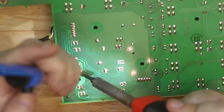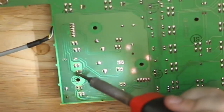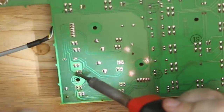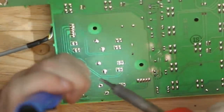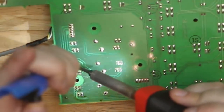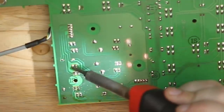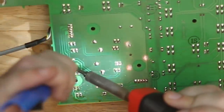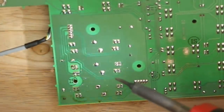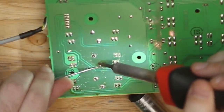Pretty straightforward desoldering. They're stereo faders, and there was an extra leg for either one end of the conductive trace or the wiper, I can't remember which. But there's four pins for each side, and then two pins in the middle attached to the case just for mounting and to make sure your orientation can't be wrong, which I appreciate as somebody who moves a little bit too fast when they work on these. But I use one of those mechanical desoldering pumps. That's never let me down. And I had to bend the mounting pins back with a dental pick.